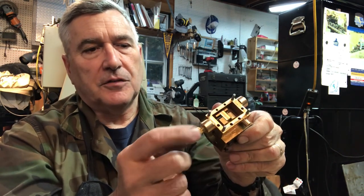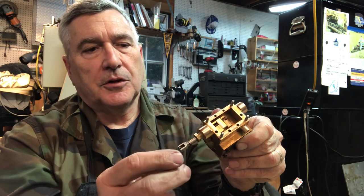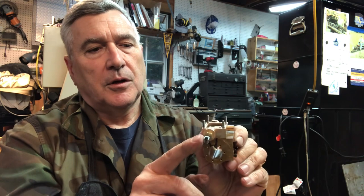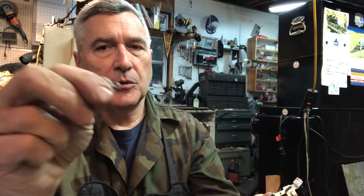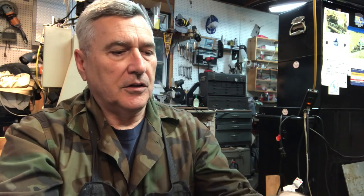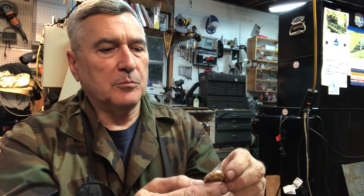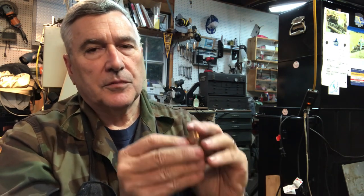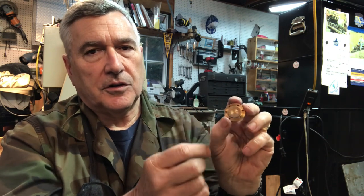This is a short episode this week. In it you'll see me correcting some mistakes that I made in the past. I remade the valve spindles with some good 303 stainless that I got from McMaster Carr. I made these clevices and I made some little bolts out of quarter inch steel to go inside the clevices. And then finally I made some hand filing of the steam passages for the cylinder covers, and I'll show you that towards the end of this video.